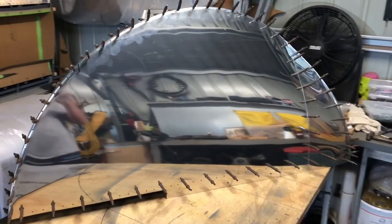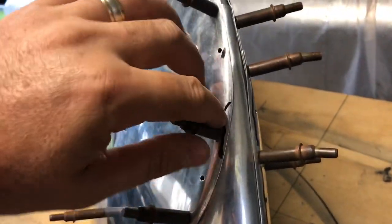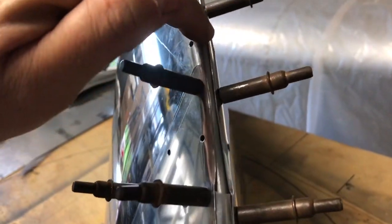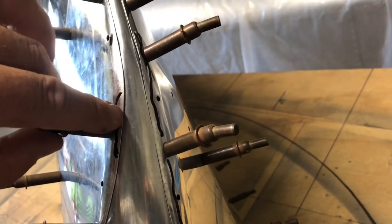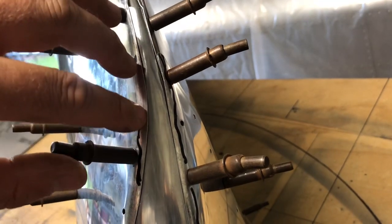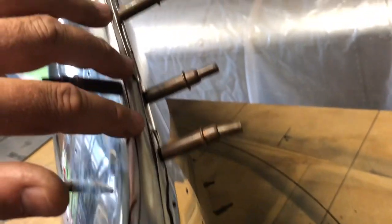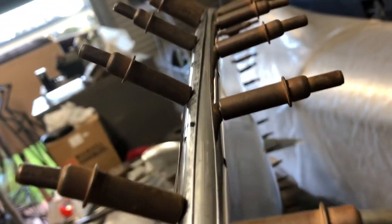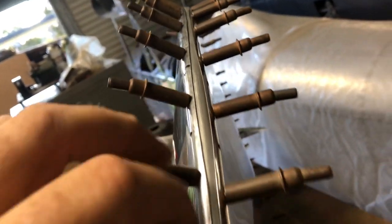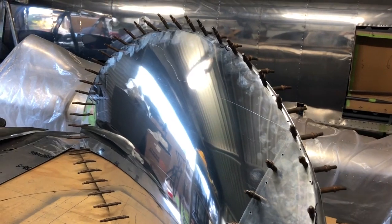This one's ready — all cleco'd together. I just spent the afternoon mucking around making sure all of the edge actually touches where it should. I go around and mark wherever it's lifted and not touching properly, then work that area a little bit more. That way you get a nice edge all the way along, and when I rivet it all up it'll come in quite nicely and just finishes things off. Next stage is rivet the sucker all together.